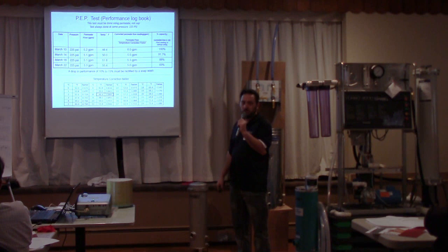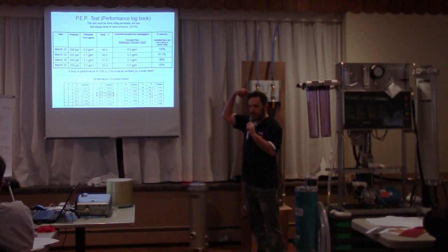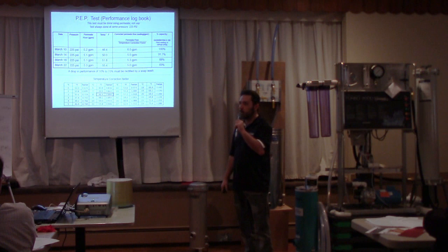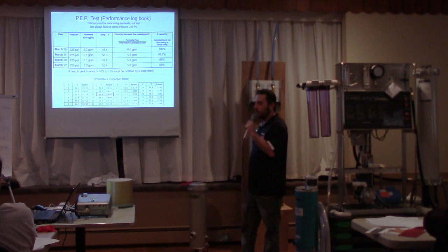That's why I recommend doing the performance test after a hot water wash and using a 10–15% threshold rather than 20% — because if you're already down 20% after your wash, you may be too far gone. For example: you're at 91.7% — almost 9% loss, not so bad. Then you're down to 88%. But looking at the weather forecast — no freezing until 3am, light rain, no wind — that's a perfect storm for a big sap run. Should you soap wash right now? You decide — but if you skip it and tomorrow is a huge day, you could drop to 20% loss and struggle to recover.